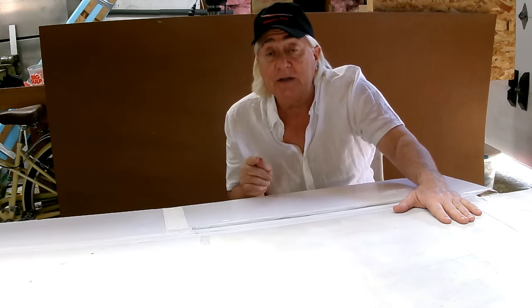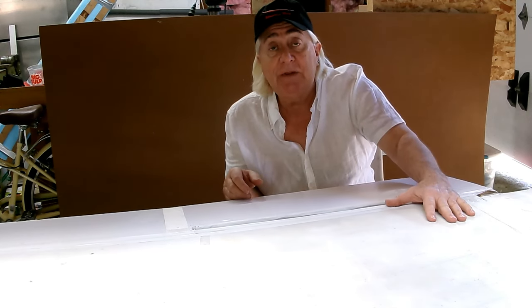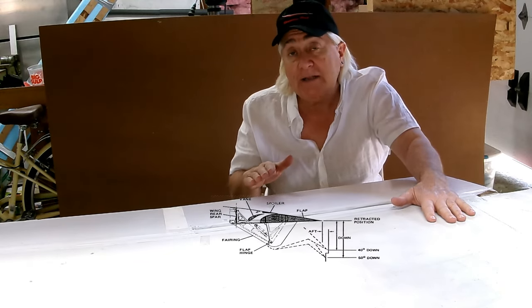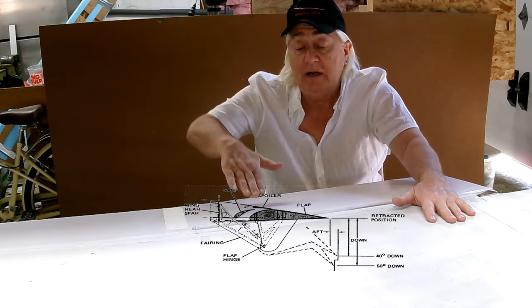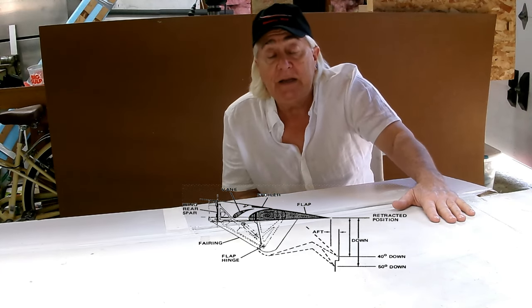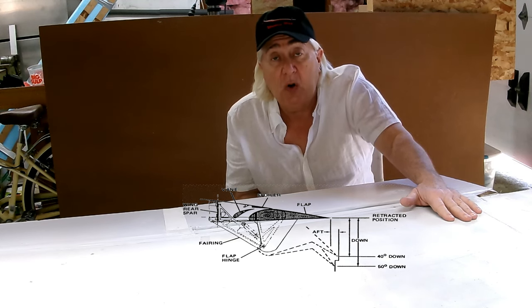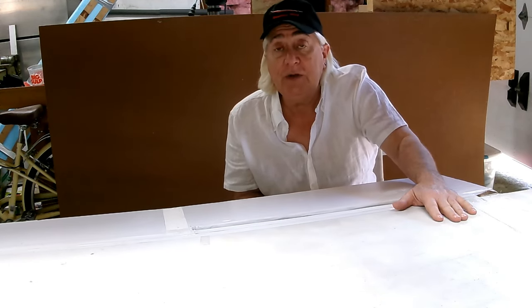I'm concerned about elevons, and elevons are a form of a flap, except they don't move aft. In order to do slotted flaps, you need a fairly fancy hinging mechanism where they can go aft and deflect at the same time. There's usually a fairly sizable metal track with roller bearings and so forth to make it all work. That's just overkill for a hang glider, so I thought: how can I get that effect but with a very simple hinge system?